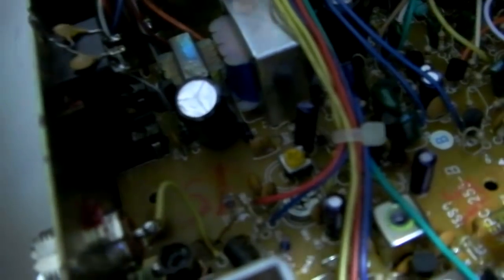If you've had a problem and the diode has failed, it'll probably be crumbly — you can give it a little touch and see it break apart, or sometimes you'll see it in pieces on the board. If you have a radio that's not turning on at all, this is one of those easy things to try. If you're good at soldering, it takes a couple of minutes. I've actually seen people throw $100 to $200 radios in the garbage because they wouldn't turn on. Two dollars in parts later and they could have fixed it. Something to keep in mind before you toss a radio that's not powering on.